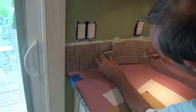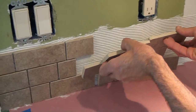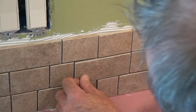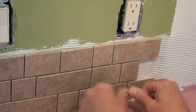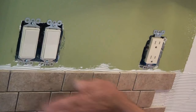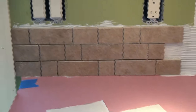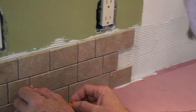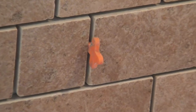You don't want mastic gooking out through your tile. There's our first tile — we're almost done. You might have a double mesh spot; I'll just put a little bit extra mastic where the two sheets are going to come together. These tiles kind of space themselves. Once you get them set and you like what you see, bump them in with the palm of your hand. Check that they feel good. Now's the time to go back and put a spacer in if needed — but these look pretty good. I'll check the joint with a spacer — looks good.